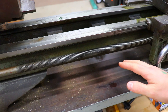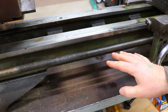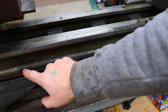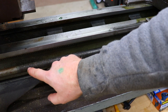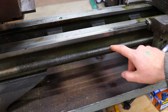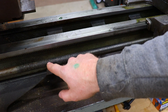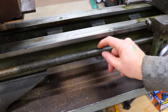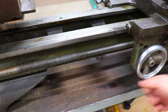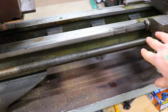Right now we can only use the lathe in direct drive, but once we replace this part we'll be able to run it in back gear, which is good for operations where we need to run the lathe very slowly. The next thing I plan on fixing is the lead screw for threading operations — it's pretty severely worn in the middle. Over here on the left you can see it's a good acme thread, and up by the headstock it's the original factory threading, but down in the middle where the carriage traveled a lot, it's worn down to almost a triangular tooth form like you'd find on a commercial bolt.